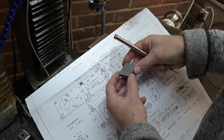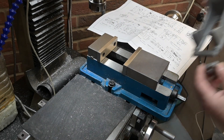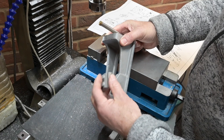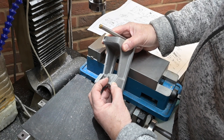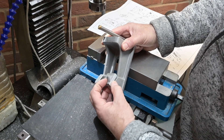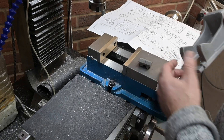All I'm going to do at the moment is just get this faced off, because what I'm going to do is face these off as well and then fit the caps — bolt the caps on prior to marking and boring them out. So anyway I'll get this just faced up, just dusted up first.